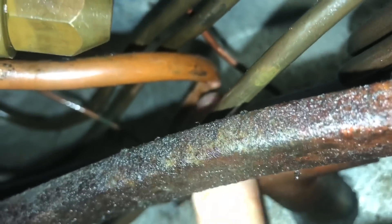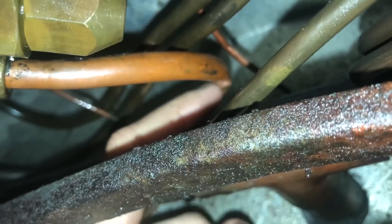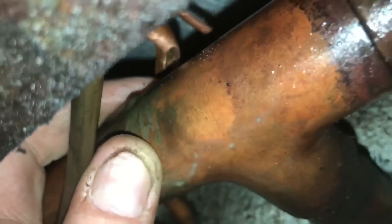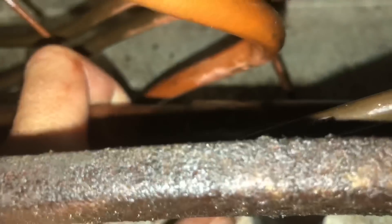These systems are so old, it's ridiculous. Anyway, they want to keep it going for now so I've got to get them going. If I get you guys a better view — see where my fingers are? It raises the pipe up a little bit. It's so hard to see, but there's a little crack right in this liquid line. I'm gonna braze that up, that's all I've got to do. Just color it in — see that little crack there? Color that in and that's gonna take care of this leak.